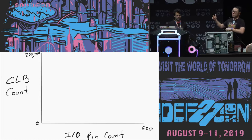So by reversing, we mean you take the bitstream, and the goal, for the most part, is to be able to recover the hardware description language and underlying logic that went into generating that bitstream. And once you have that, and if you did that 100% correctly, you might be able to modify that logic to have it do something different than its original design, and then you have to run the whole synthesis tool, redo the optimization and routing, and then regenerate a bitstream.